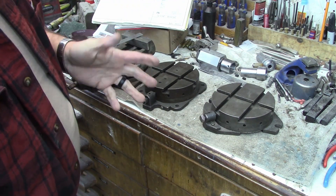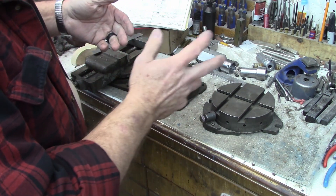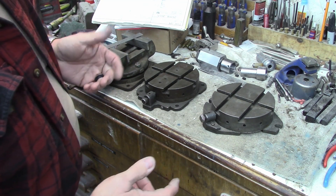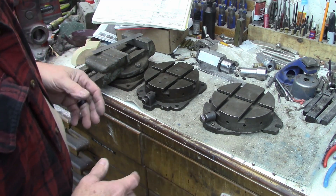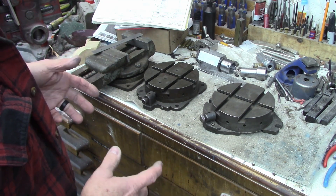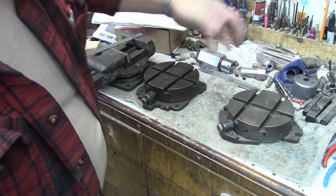These tables are not the most versatile thing in the world. I occasionally use them; they have very limited use. If you want to index to a certain position and make a cut — whether it's on the shaper or the milling machine — they're great to lock them in place. If you want to rotate them to put a radius on something or cut a radius slot, it can be done, but it's not a real good design for that. When they start advertising these for three and four hundred dollars a piece, I think they're way overpriced. There's other options — whether imported or used American-made — that have a worm gear wheel in them, which I think are a much better option. These are good for simple milling or simple indexing, but that's about it.